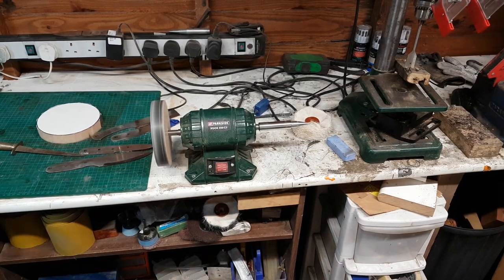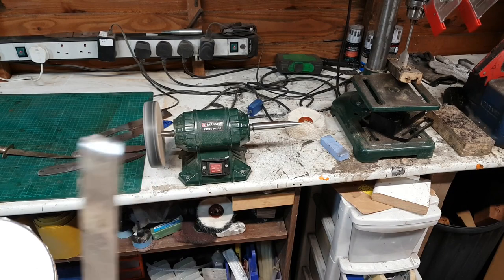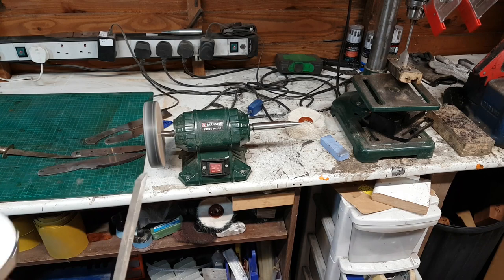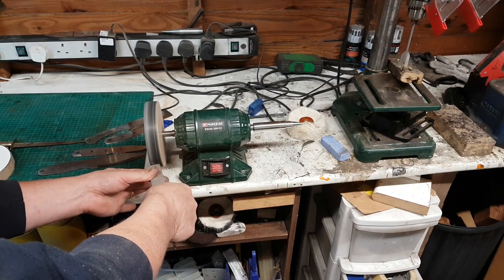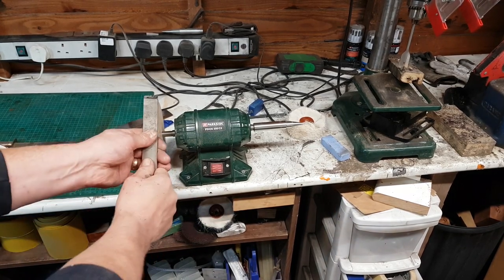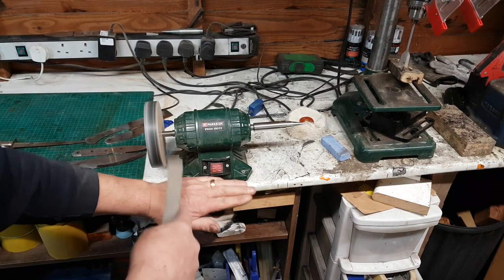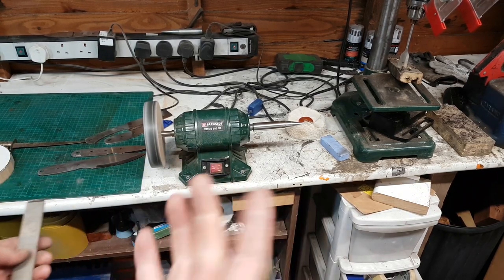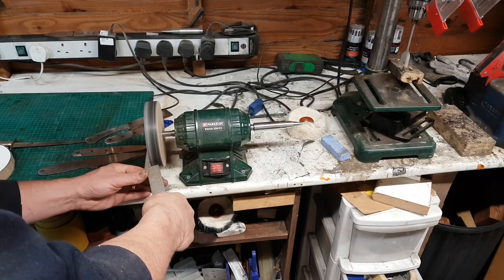What I used to go from the rough shape to the finished wheel, I saw online a guy using an old file. All I've done is made one very sharp edge on there, one good edge, and you literally just put your blade on there — you can see the material coming off — and you drag it across really slowly. Ideally you should use a rest, like a wood-turning tool rest. I don't recommend doing it without one. Then you just go across like that until it's shaped.